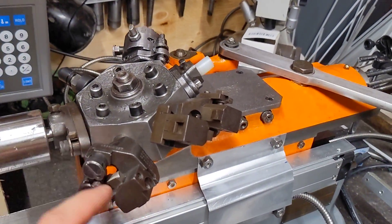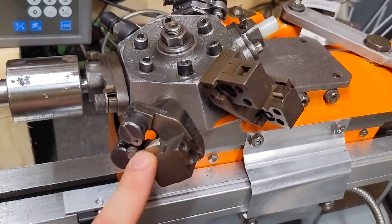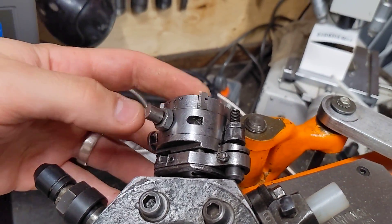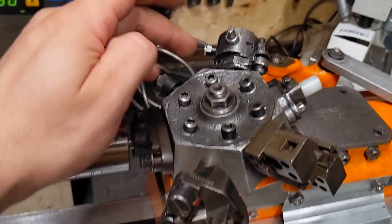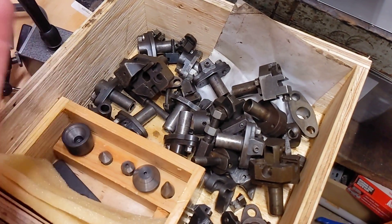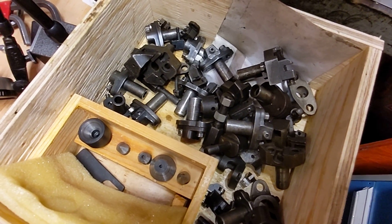So what you would do is rough cut it to size, then precision cut it to this size, and then thread it using the chasers and dies. So you get it down: big, precise, final. 75 bucks — you buy somebody's junk drawer on eBay. It's a very weird and strange place sometimes.